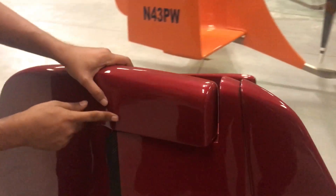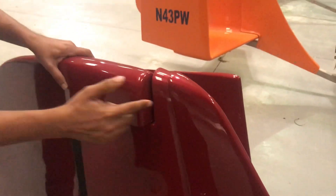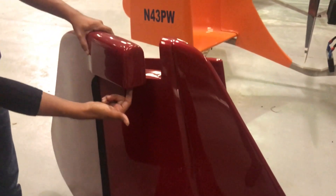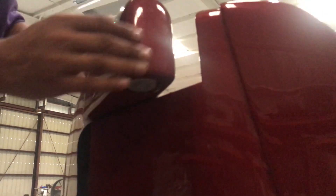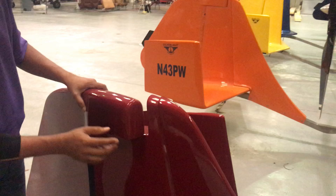It's a shielded horn in this case, because it's not exposed completely to the relative wind directly — it's behind something. It has a balancing weight up front. The weight is actually lead shot encapsulated in a bottle that's been structurally glued in there, so we can actually adjust it — we can take out some lead shot or put more in — to give us the right feel. That's the lead shot acting as a balancing counterweight.